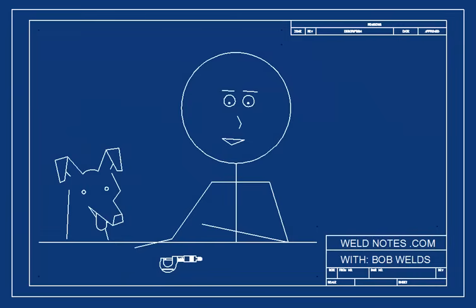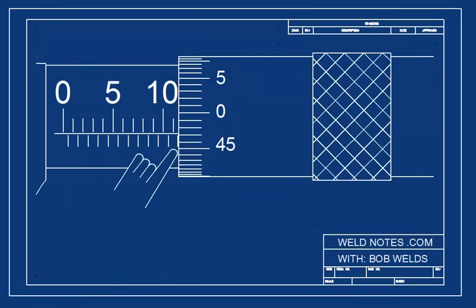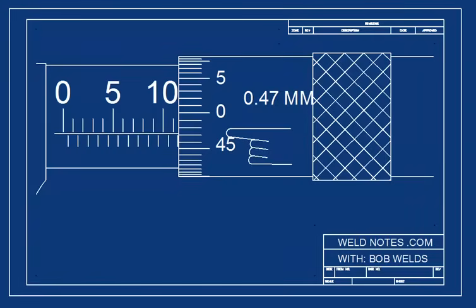There's just one more small concept and we'll be done. What if one of the marks is just barely showing? Do you count it? Is it ready to be used? Here is the trick: don't look at the mark to find out whether the mark is showing or not. Look at the thimble — you need to know if a new mark is starting or if an old mark is ending. In this example, look at how big the number on the thimble is. It's showing about 0.47 millimeters. That's a big number for the thimble. Remember, the scale only goes up to 49. Since the scale is nearing the end, it's ending, and so you don't count a mark that's barely showing.